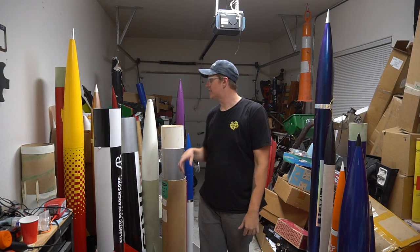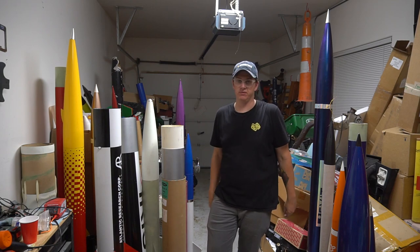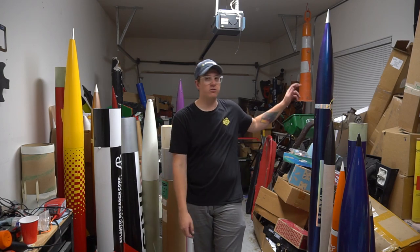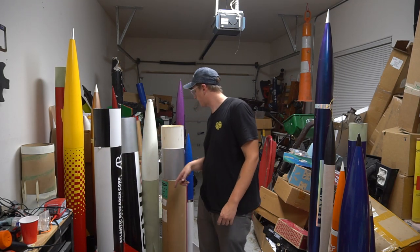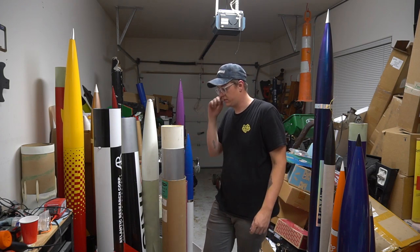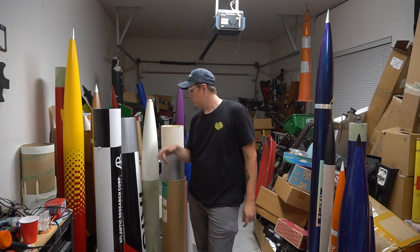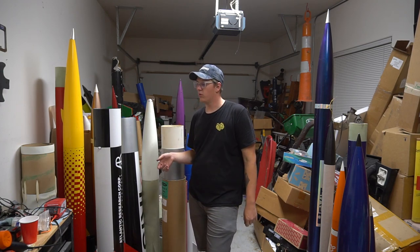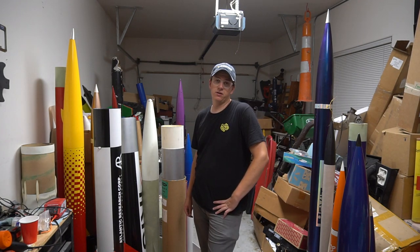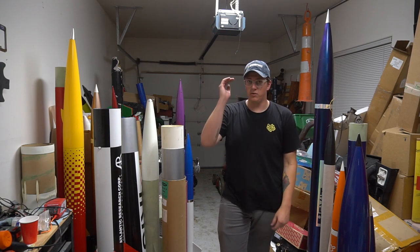The next episode is going to be pretty exciting because we're going to ground test the Iris, make black powder charges — bigger than I've ever used before. We got a lot accomplished: carbon-wrap coupler done, electronics bay mostly assembled, rail buttons on, pull plate in the nose cone, and the adapter built and finished with two rings on the bottom. All that's left is putting U-bolts in the electronics bay bulk plates, running the shock cord, and getting a big Nomex protector in there. After that, the next video is building an Aerotech N2220 Dark Matter — my first 98-millimeter motor.